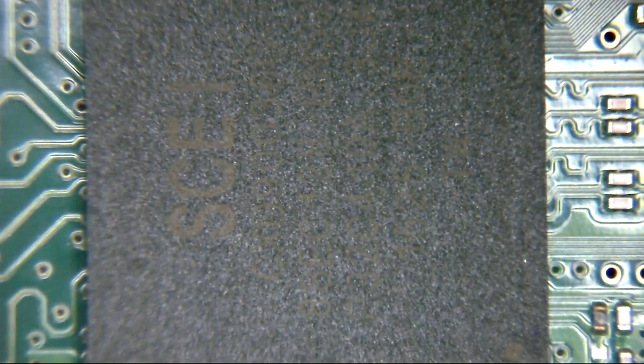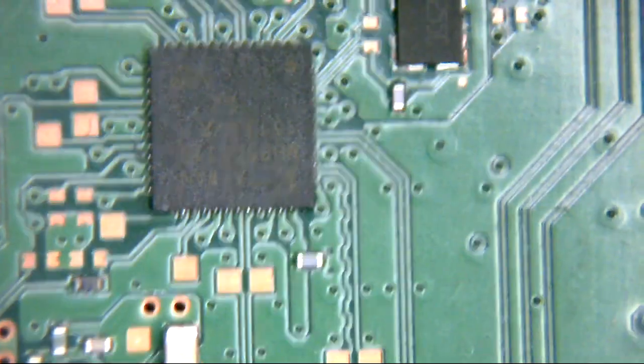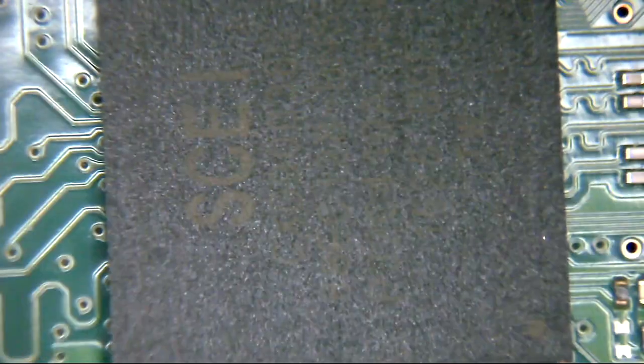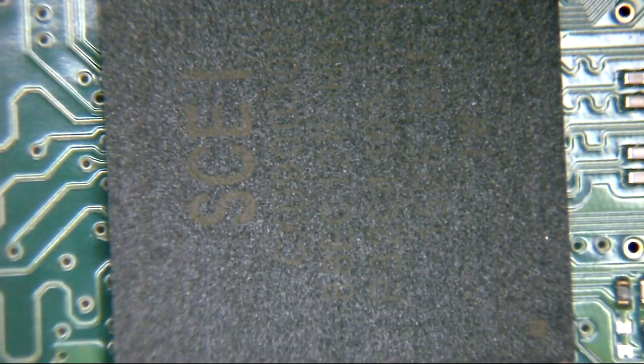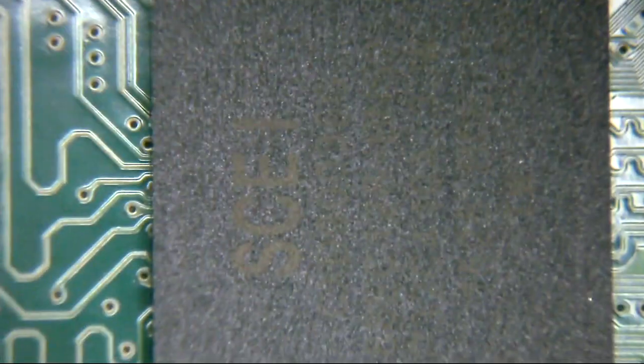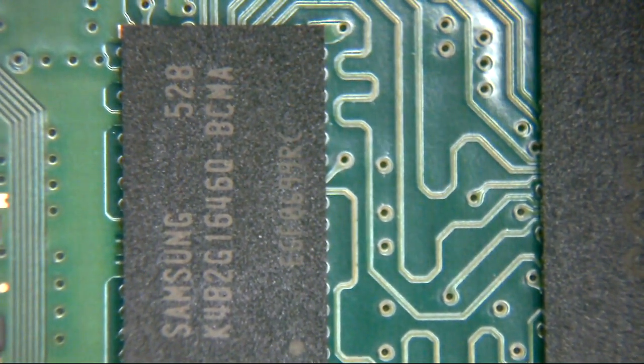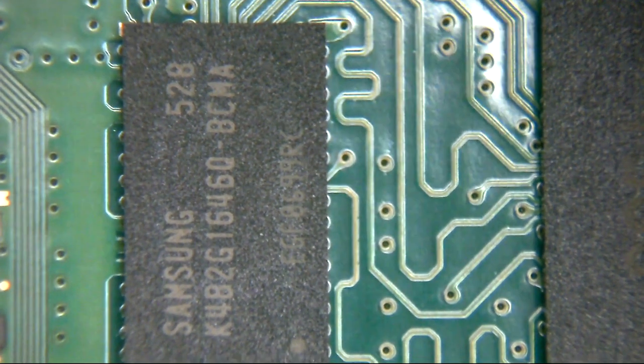Southbridge. So if we have a look at the older board, you can see that the same pathways from the back of the hard disk connector go down through that controller IC, and then go to the Southbridge. So it would appear that that circuit is now integrated into our Southbridge, which is a pain in the arse, because hopefully that doesn't mean our Southbridge has had it, at least partially had it, because that would be really bad. Oh dear, let's hope that's not the case. But anyway, that's where the signal emanates from.